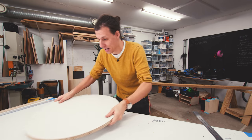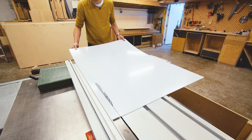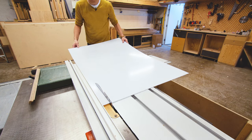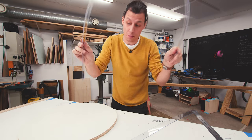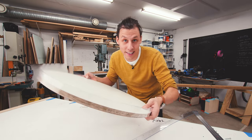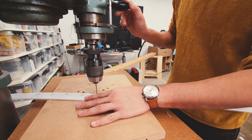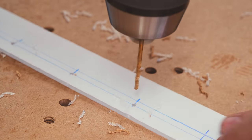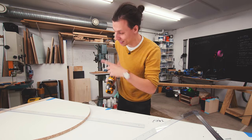Now to do that, we need to make some edges on this mold. We're going to do that with a couple of strips that I cut out of a sheet of polycarbonate plastic. Because it's polycarbonate, this thing is nice and flexible, so we can wrap it around the circle we just cut so it becomes the mold for our tabletop. I've also drilled a bunch of holes in these strips, so I'm going to use a bunch of screws to screw this on, and then we're almost done with our mold.